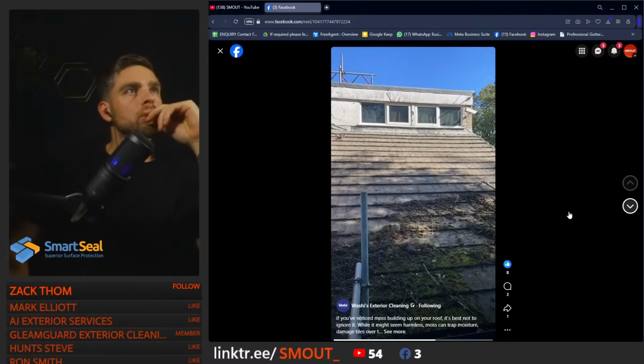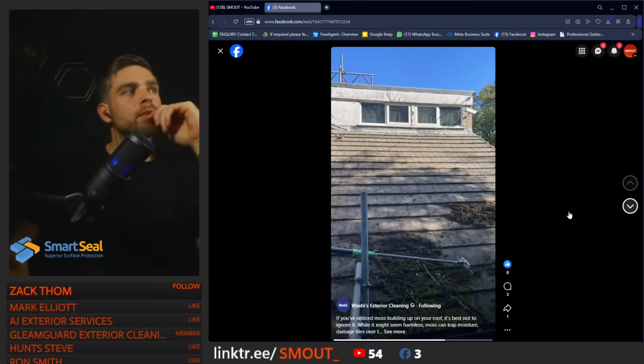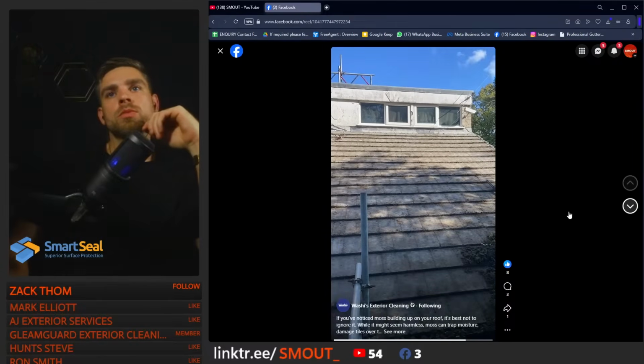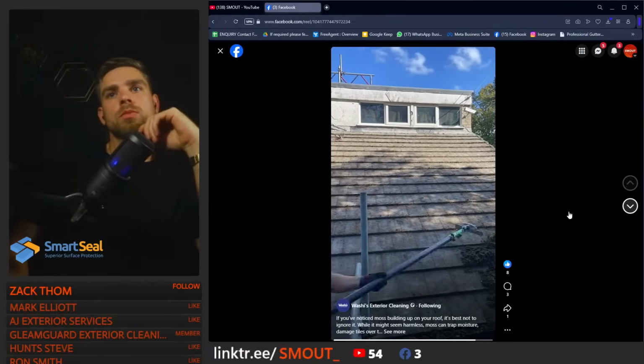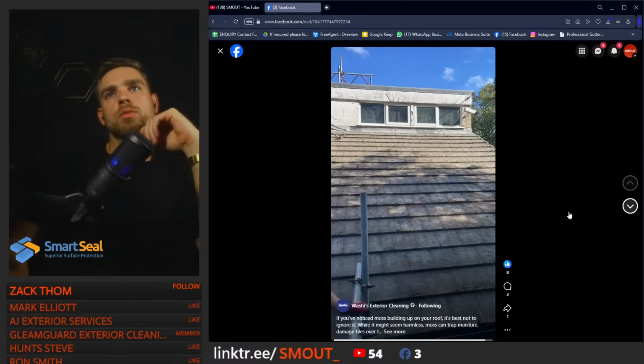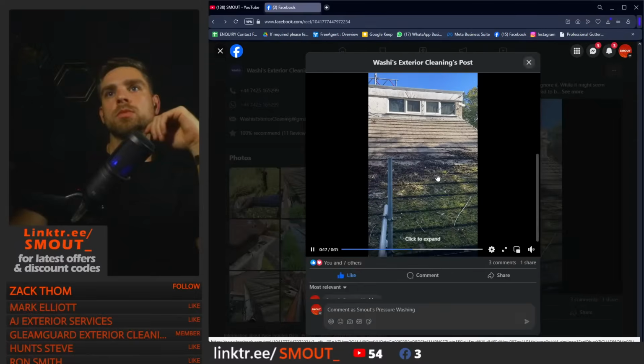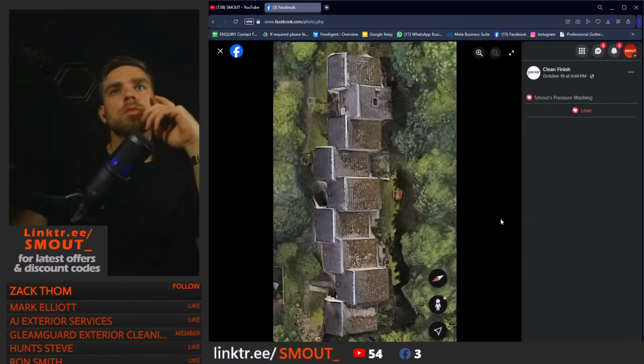With any profile tile, if you're doing it from a ladder or a tower, you can't get every bit underneath. But like I said, that's what the chemical's for. I always tell a customer, look, we aim to get 90% off. We can never get 100%. I always say 90% because I know we can do more than that, but I just set the customer's expectation. Then obviously the biocide will do the rest.